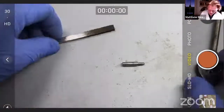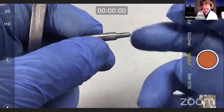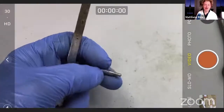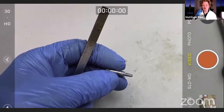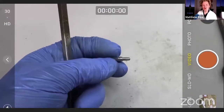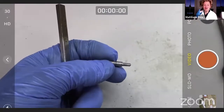So what I'm gonna do now is put the little spigot in the lathe and just try and replicate that thread, because basically all we're talking about here is the helix angle, I suppose. If we can just copy that, you could actually just file across. If I hadn't cut it off, it was still on the original bit of stock. You could just file across on a bit of boxwood or something like that, the correct helix angle.